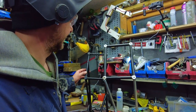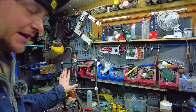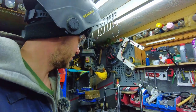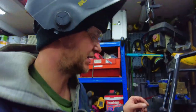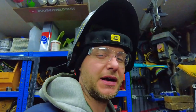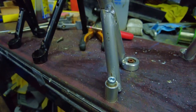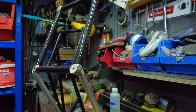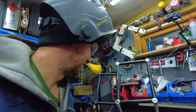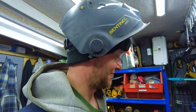Something like this — the shape is pretty much the same, just a slightly different tilt, a bit more to the left, a bit more to the front, and slightly larger. I'm trying to make it as before because it was a really good position — I could sit and touch everything, but it was a little bit too far away and too small. This one is actually good. It's quite a pain to weld because it's all free-hanging — the stuff I've done before just lays on the table and you can clamp it, but you can't really clamp tubes. I think it's going to work out alright and it's going to be a fraction of the weight — we'll save at least a kilo here.